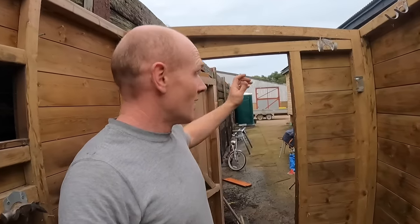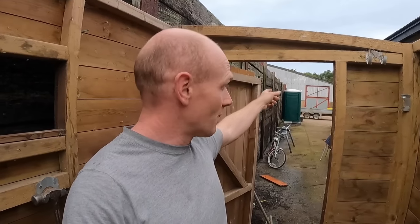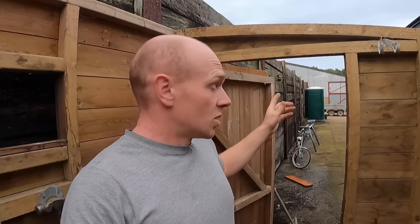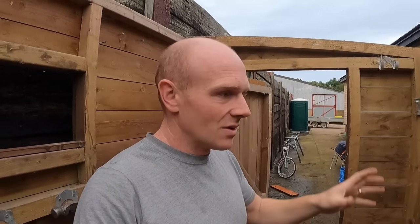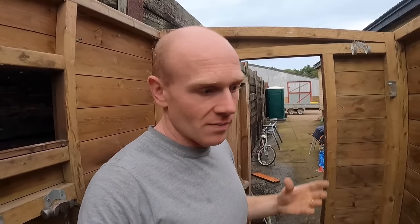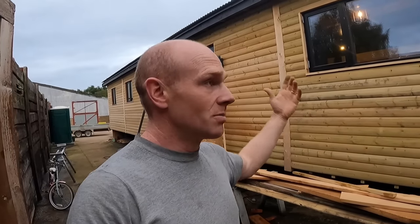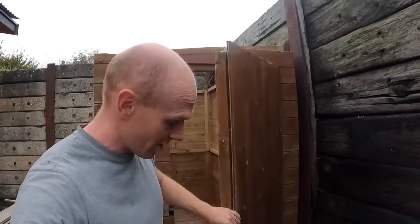Airflow is the key — you're not going to stop something from weathering by putting oil over it. It's all about air. On this farm there's treated softwood on the barn that's 50 years old, absolutely solid. And the older barn timbers are three or four hundred years old — rock solid — because all of these buildings have airflow through them. That's what keeps them dry and makes them last. Same with cladding: make sure you've got ventilation behind it and it'll last.